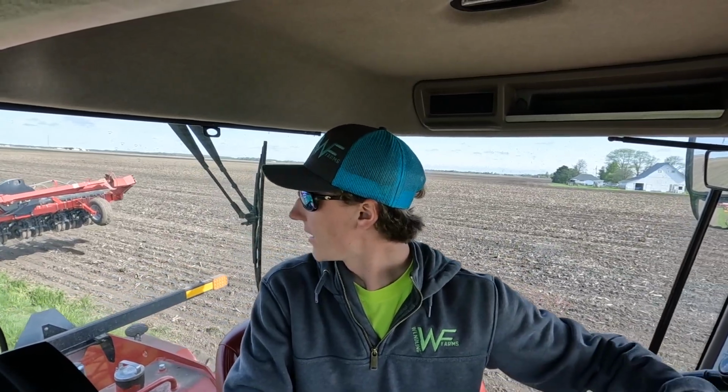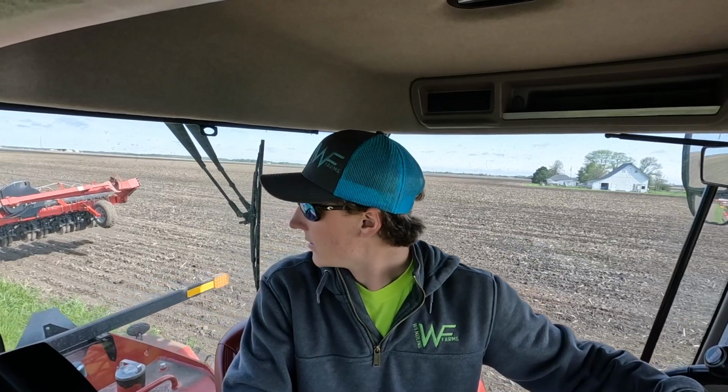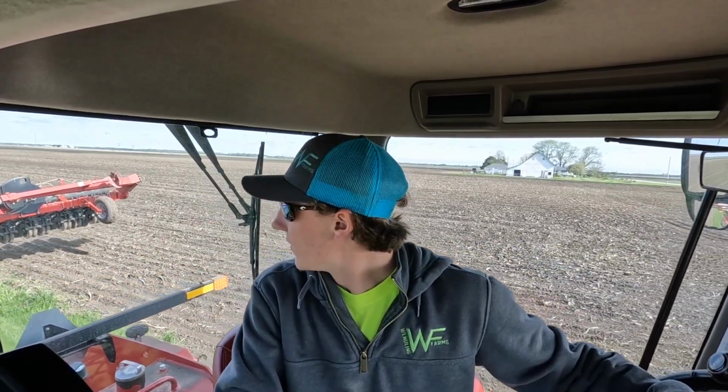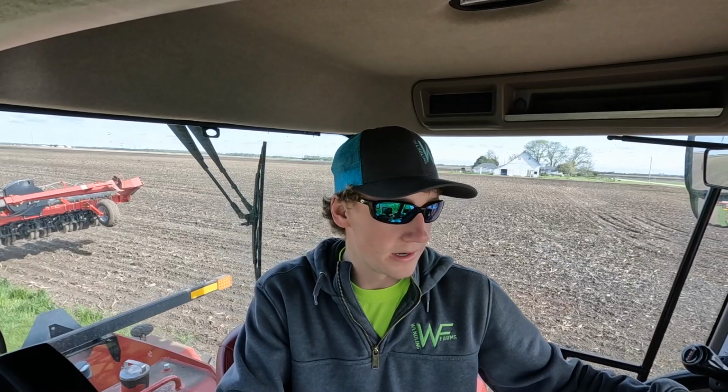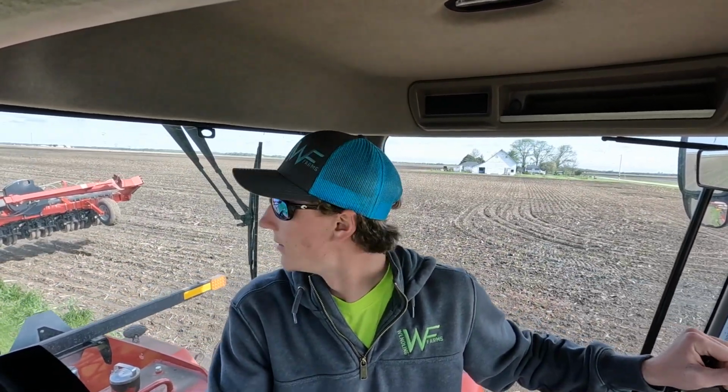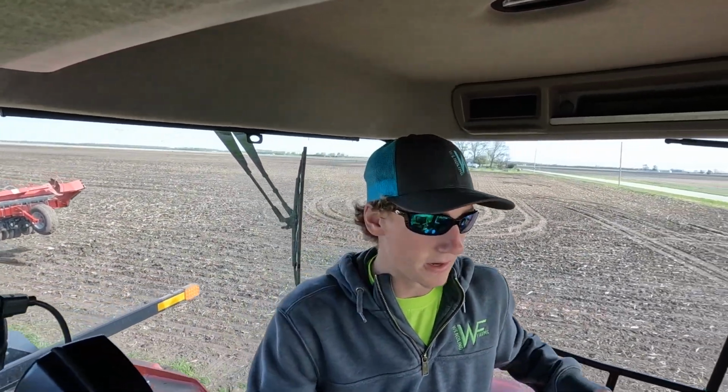Well, I'm gonna finish up this last 3 or 4 acres I got here, and then I'll be on my way to the farm. Start cleaning all these beans out of here. I gotta make sure I really clean this thing up, because you do not want any contamination when you're going from GMO beans to non-GMO beans. So I'll have to drain all the bulk tanks out, make sure they're cleaned out good, and hit every row unit. Kind of like the way you would if you were putting it away for the year.